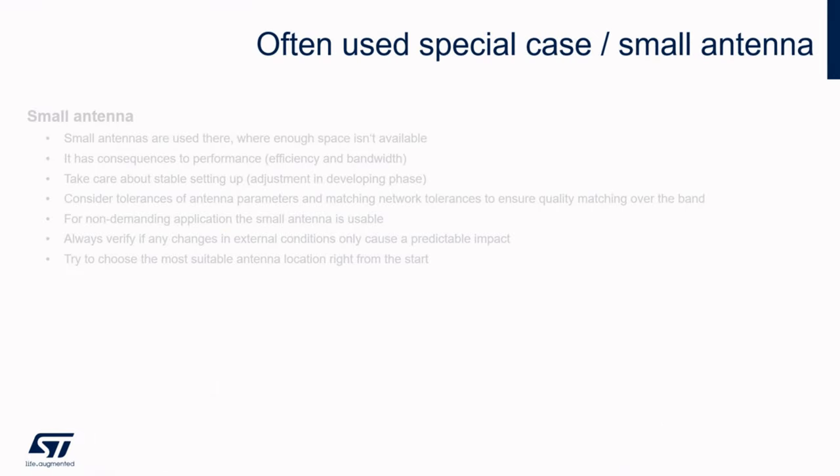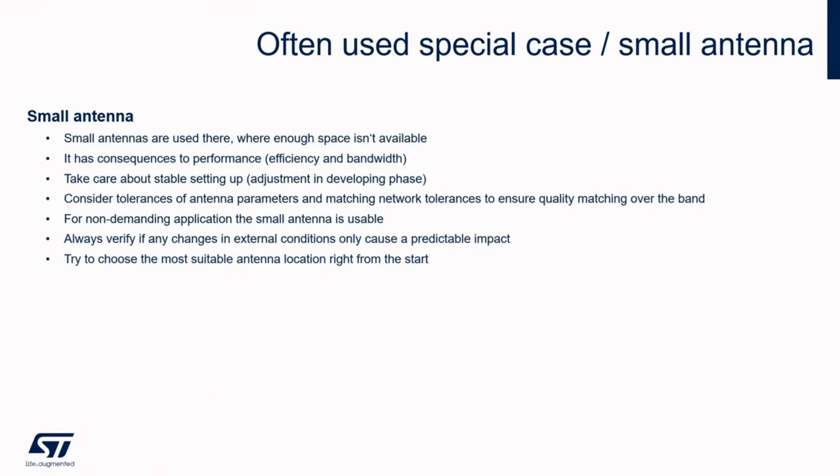One of the special cases is a small antenna. For devices that implement a small antenna, we can assume smaller range and performance. The reason is smaller efficiency — it is a trade-off between performance and a cost-effective or size-optimized solution. The misunderstanding of usage of small ceramic antennas is that people think: why not select a small antenna? After all, these are on the market and they must work. Furthermore, this fits more into my small device. The reason is likely saving space on PCB, but there is a heightened impact to performance.